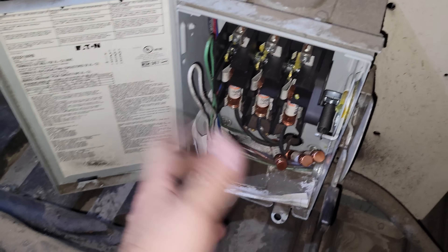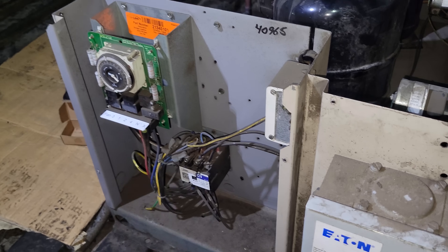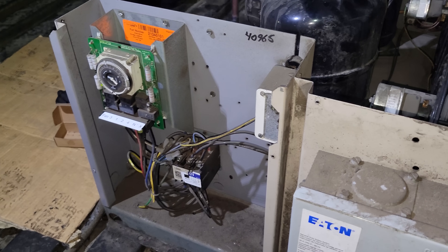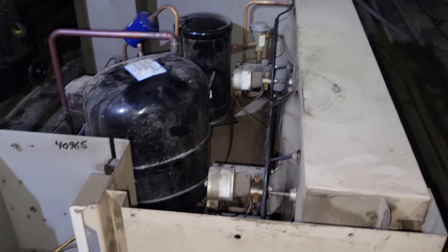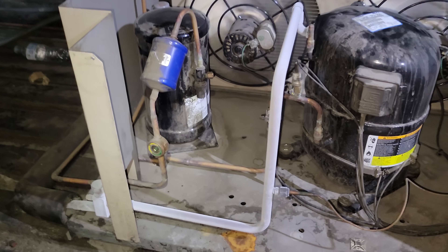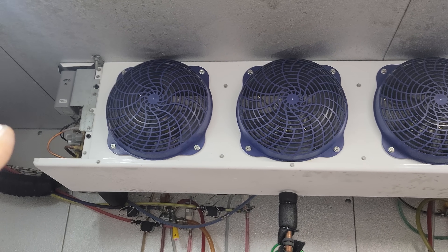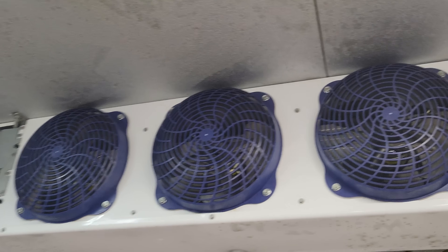We're back up on the roof. I put in three new fuses — I change all three even if only one blows — and put three spares for the next guy. I took it out of defrost and we're going to fire this up. I can hear a solenoid valve open — condensing unit is on, that's a good sign. We're going to test all unit operations. One of these motors is making a funny vibrating noise that sounds like a bearing issue, but I want to let the unit run to bring it down to temp first. Because this is electric defrost running higher temps, it takes forever to turn on due to the limit switches — there's a fan delay — and it floods the compressor on startup especially in a hot pull-down like this at 70 degrees.